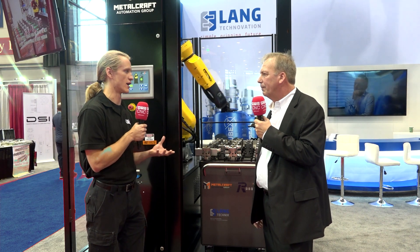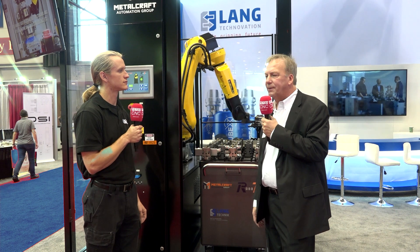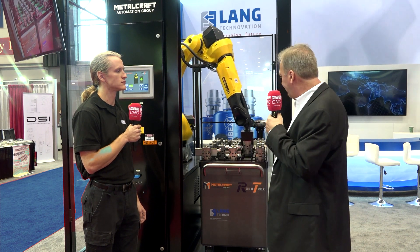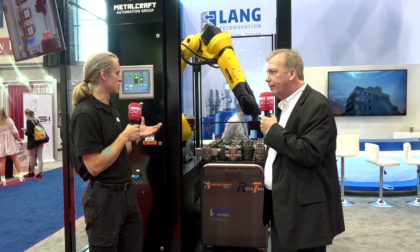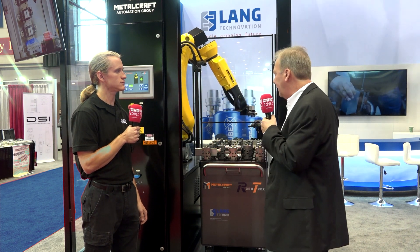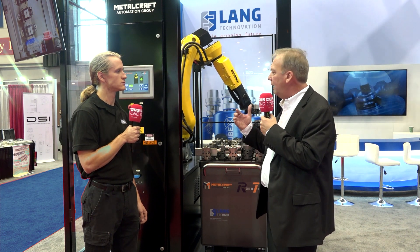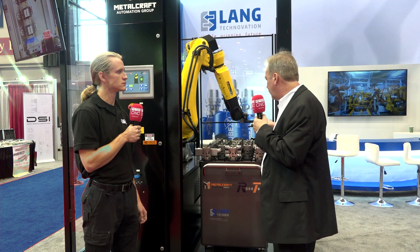With a cell like this and your customers, on a single cart — is it all the same billets, or can you have a variety of different jobs on one cart? You can have a variety of different jobs, and that's where defining the scope of the project is key — it's really how does the customer envision it? We'll look at the future, where can it go, and then look at the different pin configurations, vice sizes, and other things to get the best utilization off the entire cart. It can be low-volume work with different tasks, it doesn't have to be high-volume. It's a simple I/O interface with the machine for communication, so they're able to keep running through whatever different jobs they're loading into each of the devices.